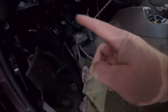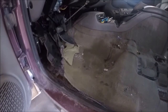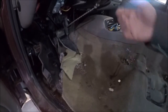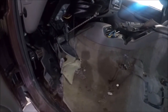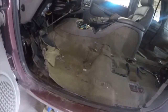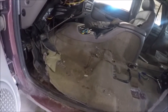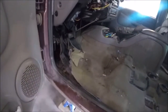But functionally, all that's needed is the key, and it turns and starts, and you guys saw that. What I edited out was some time spent disassembling and getting the brake cylinder out from underneath, and of course, I disconnected the brake switch, so I couldn't put it in gear before, so I had to reassemble the brake switch. So I'll have to rig the brake switch up to work with one of the pull braking sides, probably the left one, because your right hand will be running the shifter, just so that you have some braking applied before you can put it in gear.